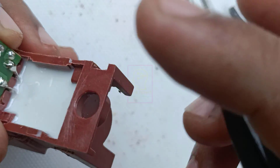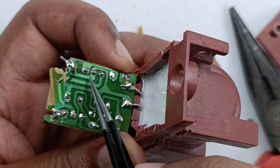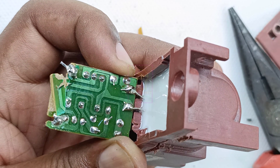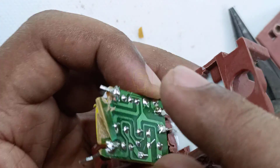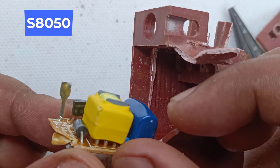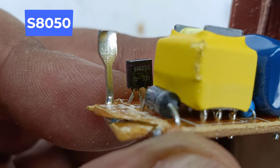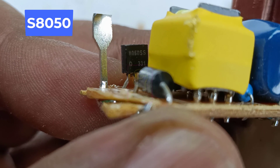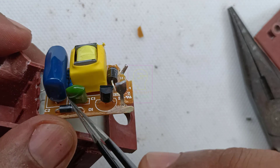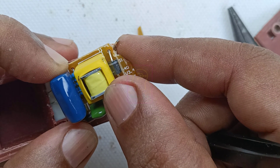The circuit board is similar to the board circuit of a mosquito bat. However, it is not using the transformer output directly — instead the output is given directly to a choke coil. You can see two wires going inside the white gum, where the voltage is raised. The transistor used is S8050, an NPN transistor. You can probably replace it with BC547 or BC546 since the ratings are similar. The transformer is a 5-pin type: 3 input and 2 output.